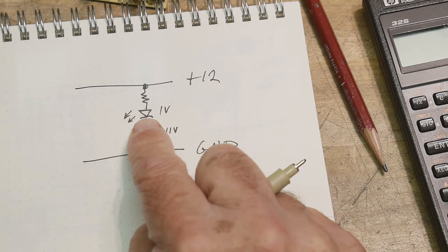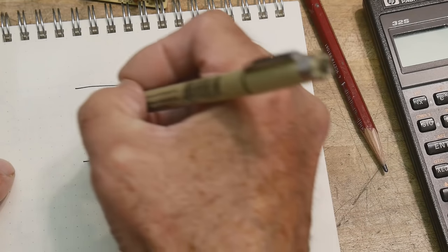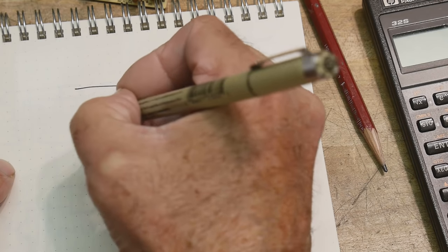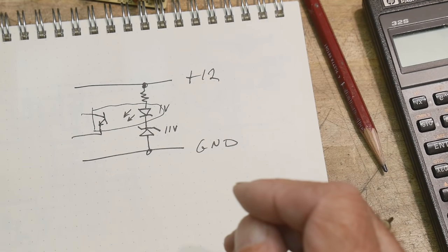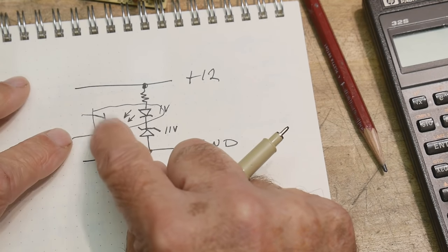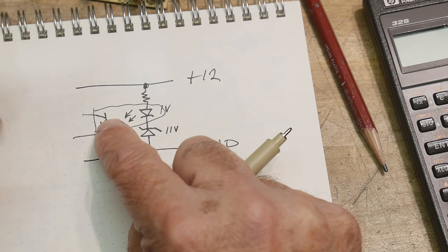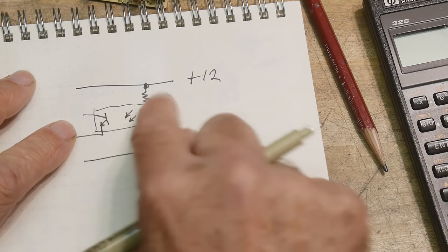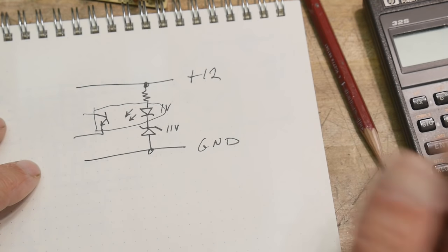And if that LED becomes very, very bright, then it will turn on that transistor in the optocoupler, right? This is part of the optocoupler. There's a transistor over here, remember? So if it gets too bright, it turns this on harder and harder, and that will tell the modulator, the controller that has the tickle, tickle, tickle thing, to stop. You're getting too much voltage, and that's the way it will modulate. It does a pulse width modulation scheme, and that's how it will regulate by this method.